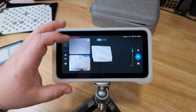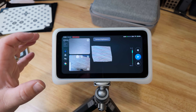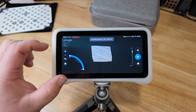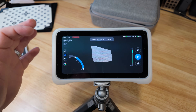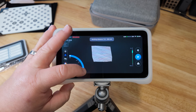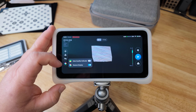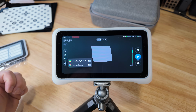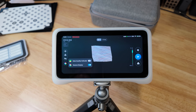Over here to the left is where you can control a couple of things such as automatic screen brightness, and you can manually control the brightness on the camera. This will help you get better scans with darker or lighter objects. The second menu down is where you can set your working distance — if you know you're only going to be within, say, 110 to 240 millimeters away, you can change that. That controls the depth of field. The little color wheel down here, when you tap it, gives you the option to show texture display and also the data quality indicator.